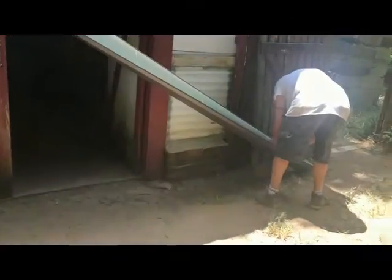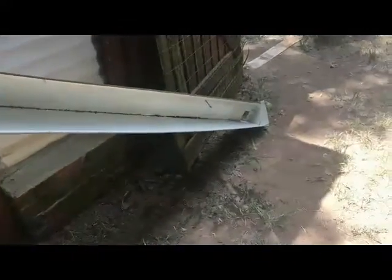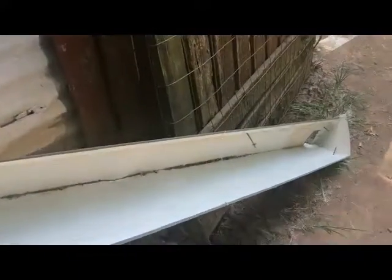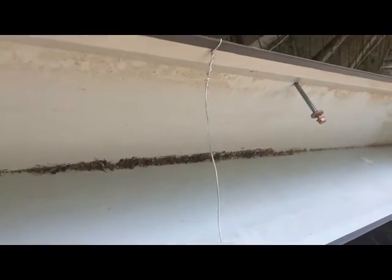What I've got to do is get it up there and figure out how much boarding I'm going to need to put under it in order to get it to actually flow out. And the fastener has a washer on it so it doesn't leak against the building. Not everybody knows that.